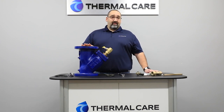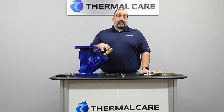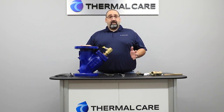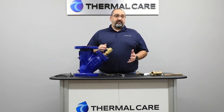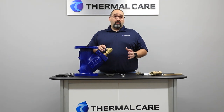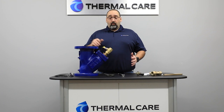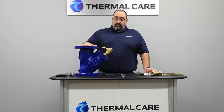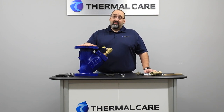What we try to do to prevent this is we install Y-strainers in our systems. The Y-strainer is basically a very simple pre-filter for the system to try and remove any kind of small debris or particles from the water before it makes it to the evaporator, extending the life of your chiller. What we're going to be discussing here is the maintenance on the system — how to remove, identify, and find the strainer in your new chiller system.